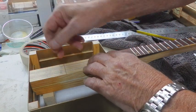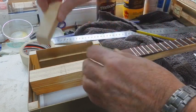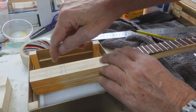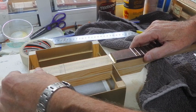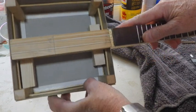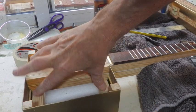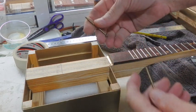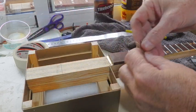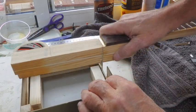From the underside I'm going to drill all the way through here with a clearance hole — that's the way I'm going to do it. Clearance hole all the way through, and glue this to the base. Then I can screw through that base into here underneath to hold it all in place. That's the two blocks made up. I'm leaving them quite big so I can give a little bit more support on that base. I'm going to glue those in place now, clamp them, and when they're dry that's when I'll drill them. From the back I should be able to drill the base and screw that through. At any time if it needs to come out, just unscrew it from the bottom — everything can be dismantled.